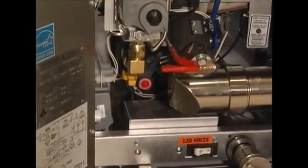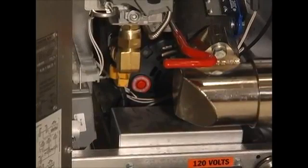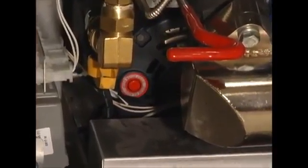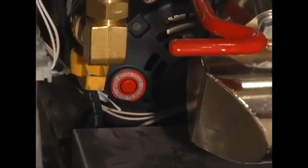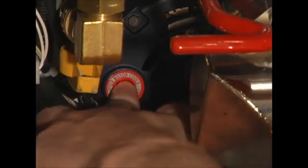If the pump motor becomes too hot, it has a thermal limit switch which may trip. Allow the motor to cool for a few minutes and try pressing the reset button. If the motor tripped, a problem in the filter system exists. Resetting the circuit breaker over and over will not fix the problem. If the issue cannot be found, an authorized service agency will need to be contacted.